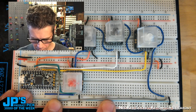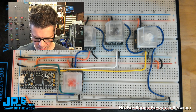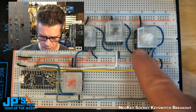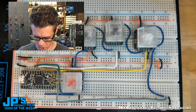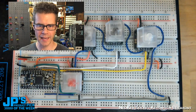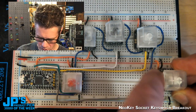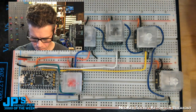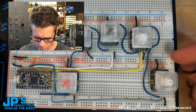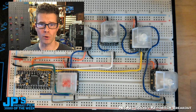You can see the arrangement of wires is essentially this blue line is the NeoPixel connection. So that runs in and then out, in, out, in, out, in. And I also have a blank spot here that we're gonna plug a switch into. In fact, let's go ahead and do that now. So you can imagine we're doing some sort of ergonomic layout. And so I've got a switch here. I'm just gonna align that top left there. With power. In fact, it's duplicated on top and bottom on some of these so that you can have more flexibility in your arrangement on a breadboard or a perma-proto board.